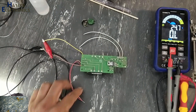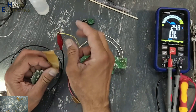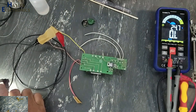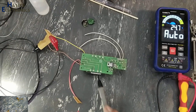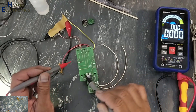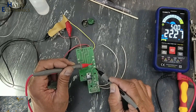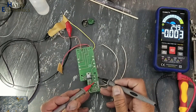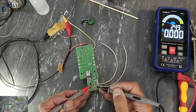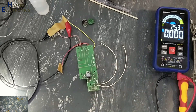Take care for your safety because we will deal with unisolated live voltage. Never touch in this area as there are live voltages. AC voltage reads 237 volts, output 22 volts DC, rectified voltage 30 volts. The regulated output of this regulator is 12 volts — LM340-12, which is similar to the 7812 IC.